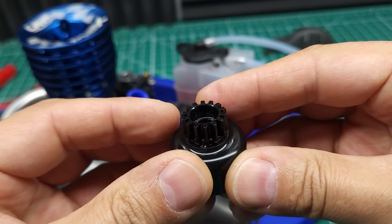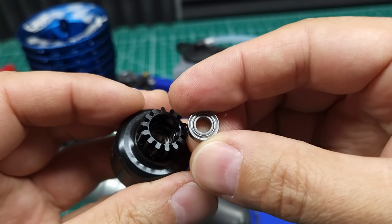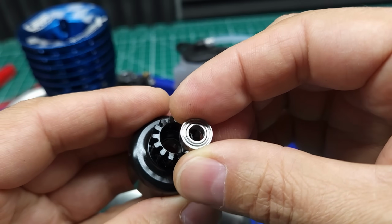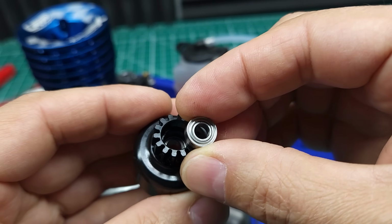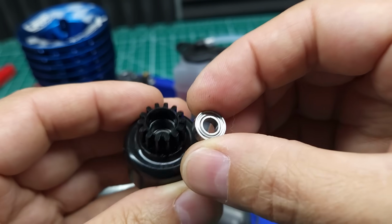All right, so it turns out there's a defect in the bore the bearing was in, and it was squeezing the bearing so hard that it jammed the bearing up internally. These small bearings depend on really tight tolerances to work properly, and if you squeeze them really hard, even though they're made out of steel, they'll jam up like this one did.